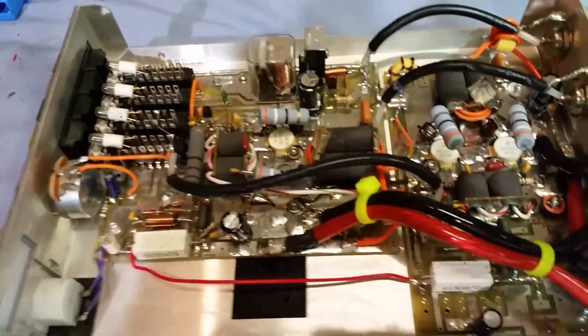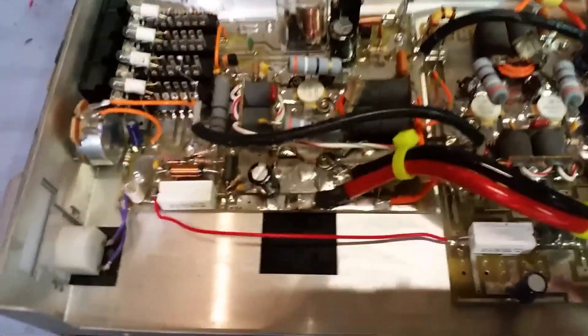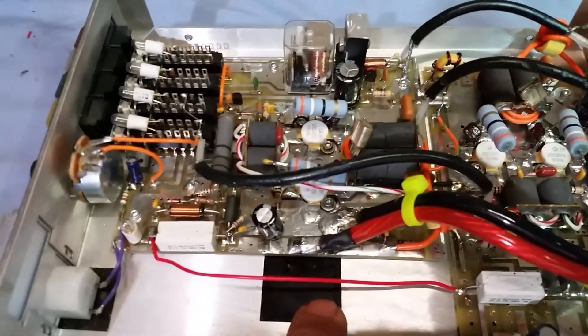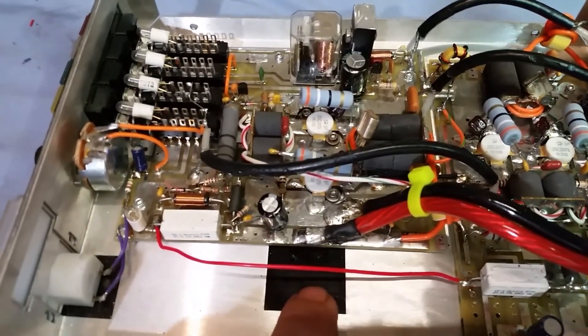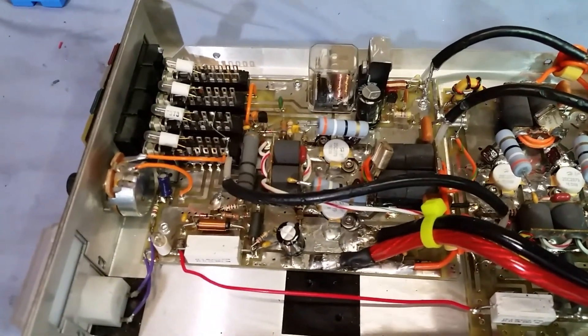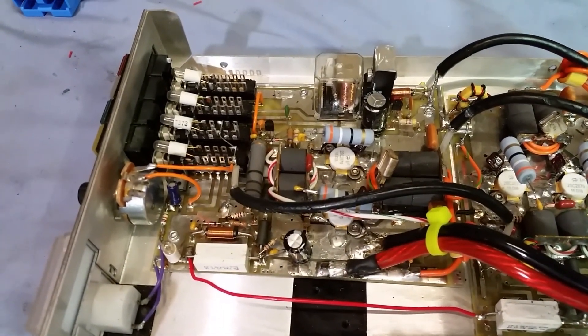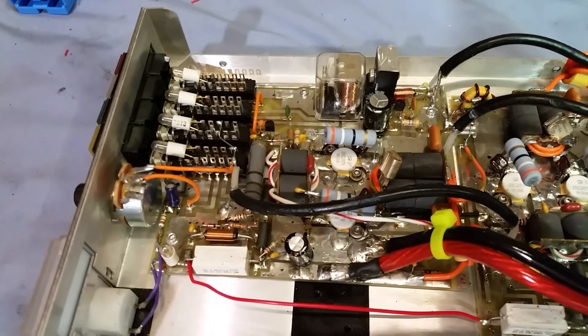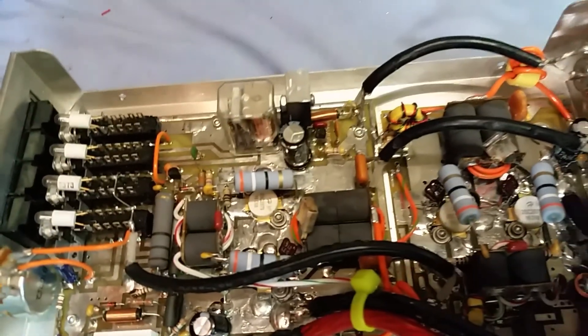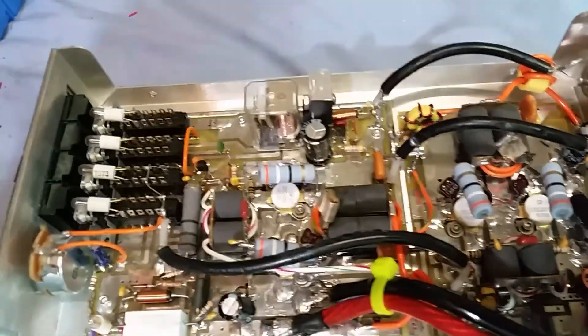I could take this up to 16 volts and it's not going to affect the bias circuit. I do have a more sophisticated regulated bias circuit in mind, which will require a pass transistor along with the regulator — thinking about putting it right here for the 500s. That will allow you to run Texas Stars on higher voltage without affecting the bias at all, which is one of the biggest reasons why Texas Stars are voltage sensitive.